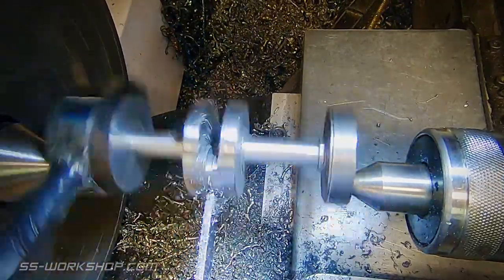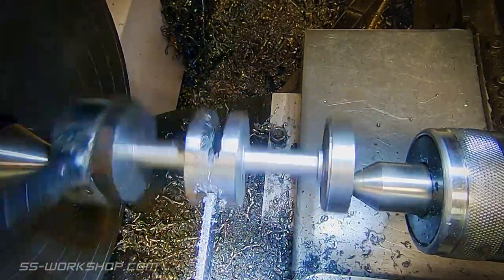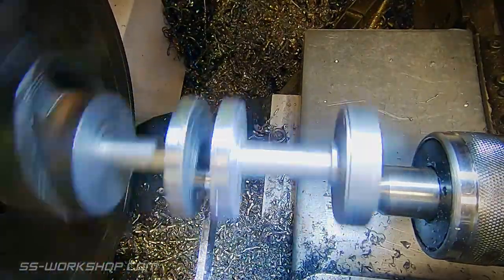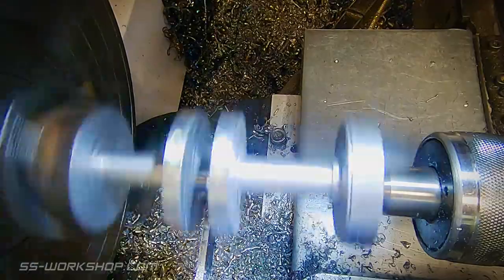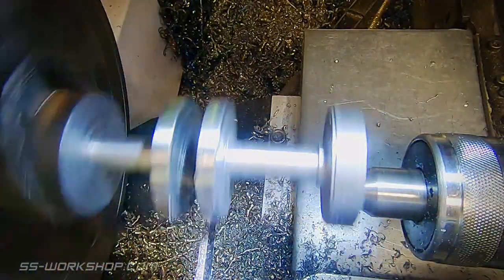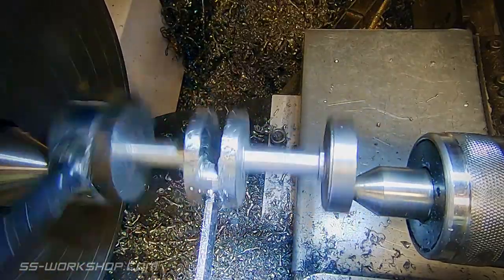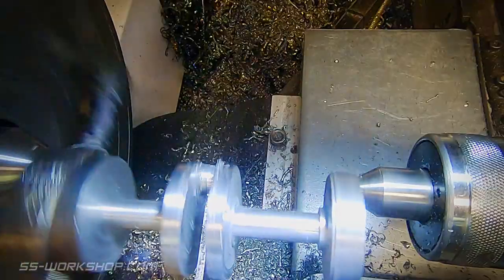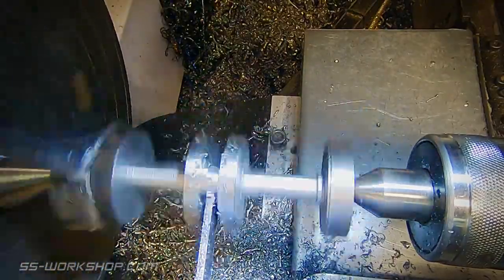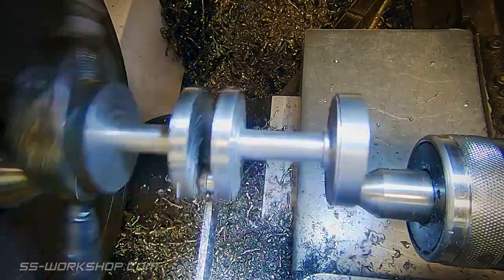Cut length is now much longer, with three quarters of the rotation now being cut and a quarter being air turning. One thing I will note is it's just as frightening to turn as it looks, with it taking me some time to gain confidence having a part moving so wildly in the lathe. At this point I've just started making full cuts, now just reducing the eccentric crank to its final size. The part is very fragile at this point, with very little rigidity between the two shafts.